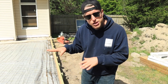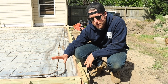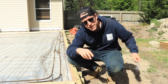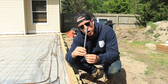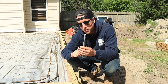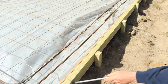We have our slab here just about ready for concrete — we have our rebar, our helical piles, our wire mesh, all of that figured out. Now what we're going to have to do when we pour this slab is put in these J-bolts. These will be wet-set into the concrete and will hold our entire structure down to the slab and make it one. These are really important, and the placement of these is really important.